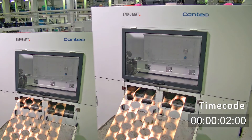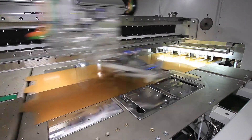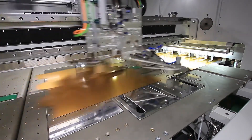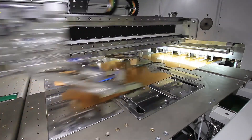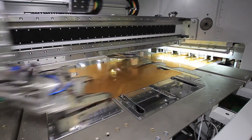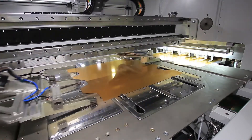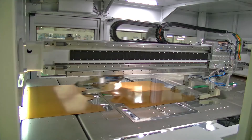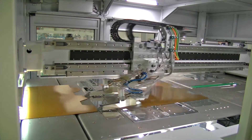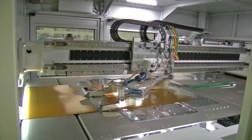What's different about this machine version? To achieve this high output, a new double feeding system with gripping tongs powered by linear motors has been installed. The gripping tongs feature a collision-free arrangement. Together with a direct digital position detection system, they guarantee extremely accurate positioning and the maximum acceleration of the sheets.